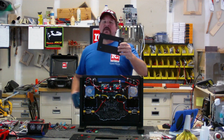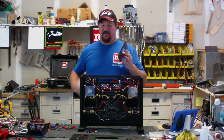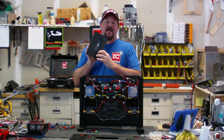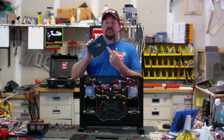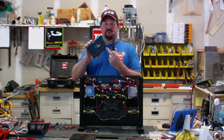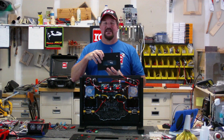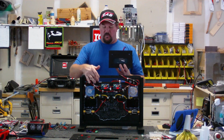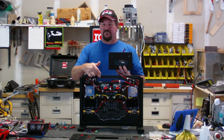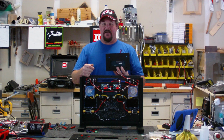Then we take a custom mounting plate. The reason why this has a hole on it is for venting. Heat is bad. And then we mount the charger to that with bolts, and it actually goes into holes that are on the chargers to begin with. Then once this is mounted, it goes into the case and is bolted in again. So this gets bolted to the charger, this gets bolted into the risers, which is welded to the PVC. It gives you a perfect mounting system that is never going to fail.